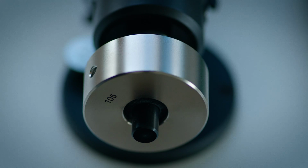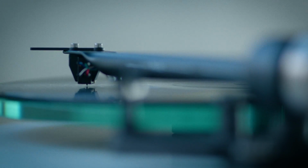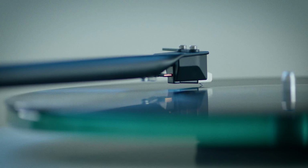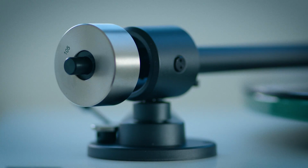in the groove. The counterweight is also very special because a tone arm is reacting as a moving spring. We have a resonance frequency. That means together with the groove, the cartridge is moving, and it can happen, especially when you have warped records, that you have resonances, and these are damped by our counterweight. And again, here on the counterweight, you can see it's moving a little bit. You have here resonances which are caused by the cartridge in the tone arm itself.